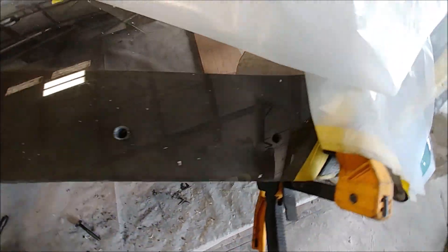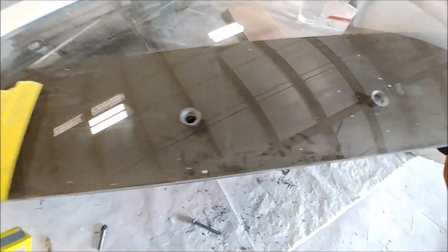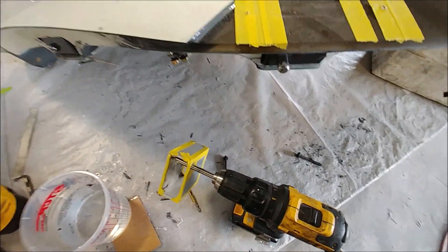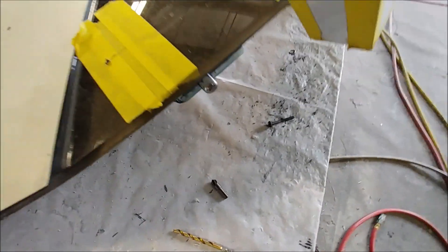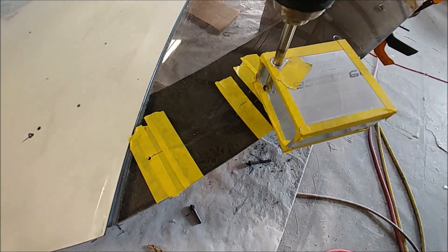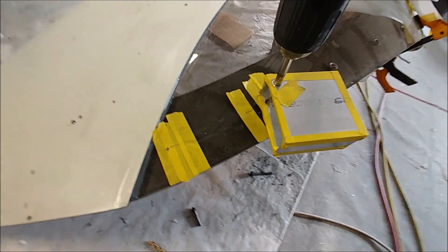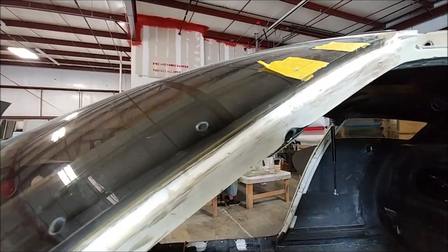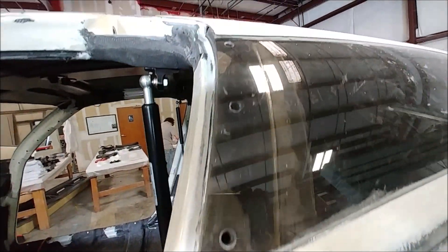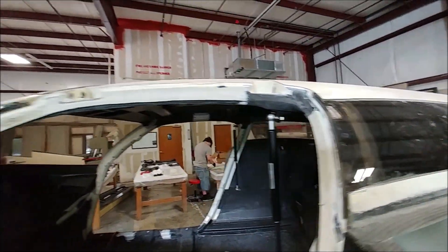A little bit later on I moved on to the door. Just to show you how I make sure to drill perpendicular — or normal — to the surface, I have a little fixture which is just a bit of aluminum channel with a hole drilled through it. I hold that on the surface with one hand, get it nice and flat, and then drill the hole so it goes straight through and not on an angle. Here, a little further along, I've still got two to do over there and I've done the ones on this side, so almost all the holes are done on the fuselage now.